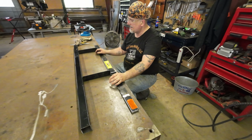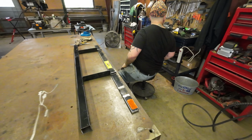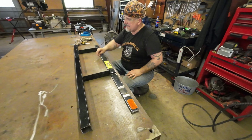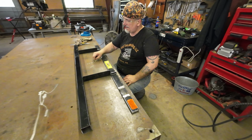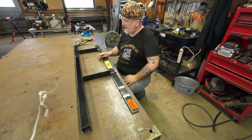So what I'm thinking is we want 2 caps on, or a cap. Let me think. Each cap is an 1/8 inch. So the cap on the end out there and the end on there, that's a 1/4. So that's a 1/4 per side. So that's a 1/2 inch. So far, we've taken a 16th and a 16th out. So that's an 1/8. So if it was snug, that would be 3/8. Or we'd have to take out 3/8 more to equal up to a 1/2 inch to make it snug.